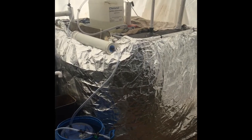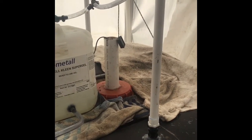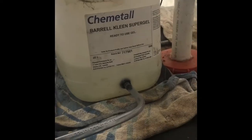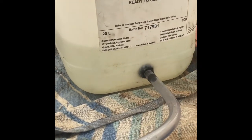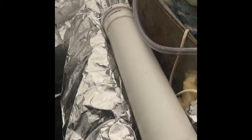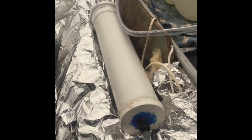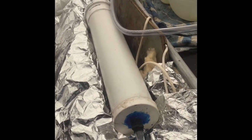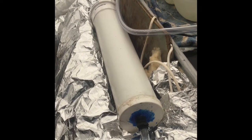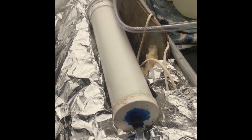You keep flushing until you start to hit flammable gas. After a lot of trial and error and using bulkheads instead of uniseals — which I should have done like the SolarCities design — the gas goes up through the tubing, down into the water which scrubs out the CO2 making carbonic acid. Then lots of valves and a lot more tubing into my hydrogen sulphide scrubber. It's just packed with fine steel wool from Bunnings, made airtight, and that takes away the hydrogen sulphide which is corrosive to metal — so if you plan on compressing it or running it through a water heater or a cooker, you don't want it eating your stove or any metal components.